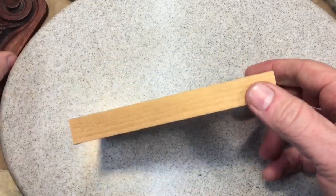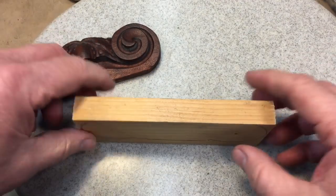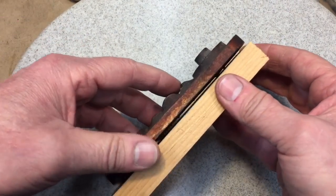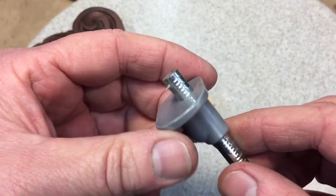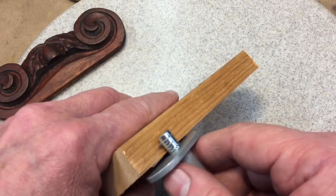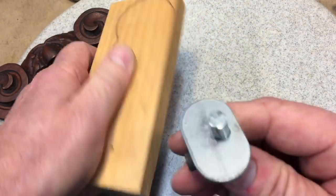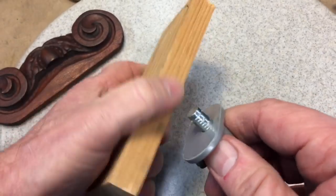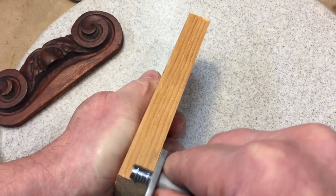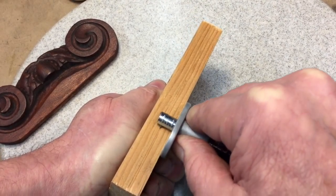Next up, we have our marks. Now you can see this is quite a bit thicker than this piece, so we got to thin it out a little bit. A lot of you don't have table saws — the easiest way is to rip it through a table saw, but if you don't have one, I'm going to show you. You get the approximate width you want and that's when you use this tool here — it's a scribe. So you see that little point in there. We want it to be about this thick. We're going to run this scribe down the edge of the wood on a slant. The reason for the slant is it helps you run it down straight. We run it down a couple of times — usually three is enough to make a nice indentation into the wood.